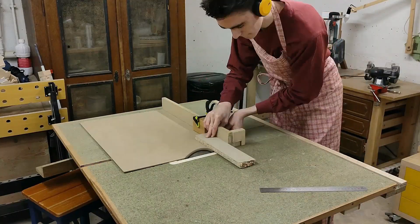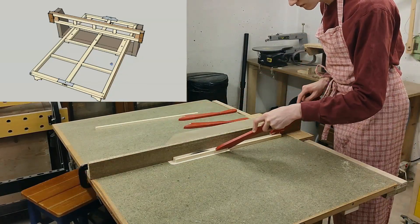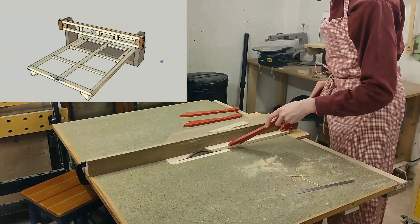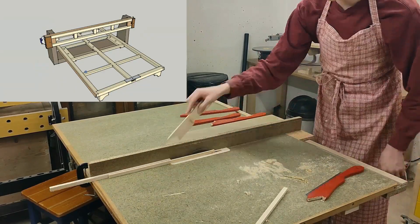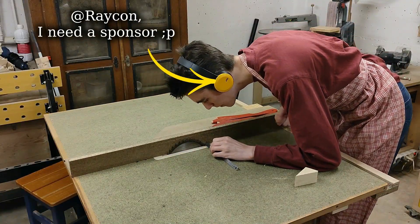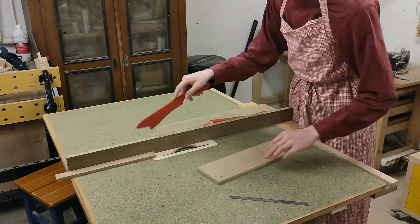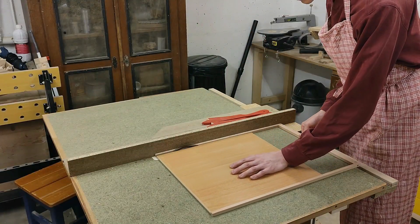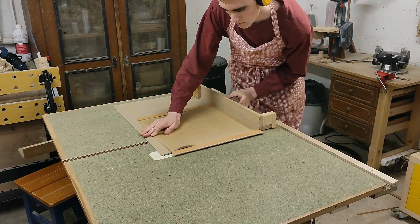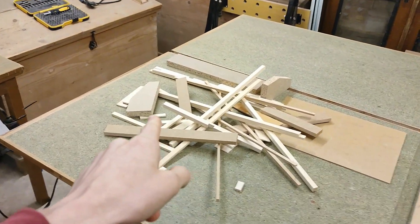I'm going to keep talking while on-camera me does all the work. As you might have noticed, the main structure of the plotter is pieced together from many thin slats, pretty much the way you'd build a balsa wood airplane. That's mainly to save material and make the thing lighter for the 28BYJ to push around, but also the less wood it's made of, the less wood there is that can twist and bend. Most of the oversized matches I'm cutting here are 6mm thick and 12mm wide, mainly for standardized dimensions. The print bed is best cut from a material with a sealed surface so you can wipe it clean in case it gets scribbled with ink soaking through the paper.